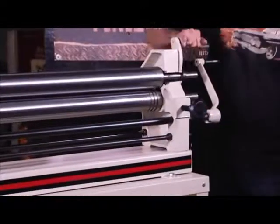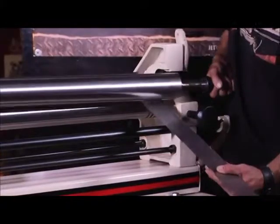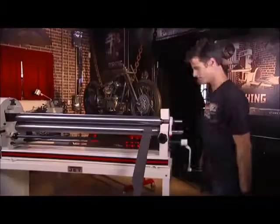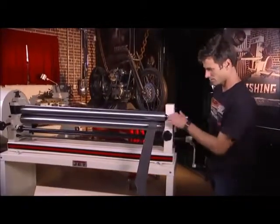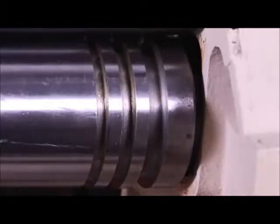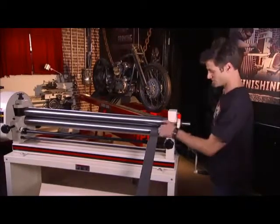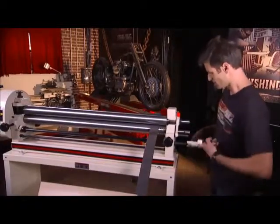To open it up, pull it over like that, pull her out, slide your material in, and go ahead and click it in. Slide it back down in place. The goal is you've got material thickness right there. You can also do a quarter inch, five sixteenths, or three eighths like solid bars, so you can roll rings and such — whatever kind of weird pieces you like to put into that. That's actually a really handy tool. At that point, just go ahead and start rolling.